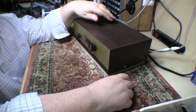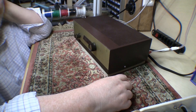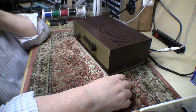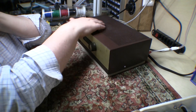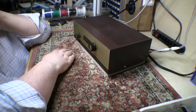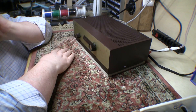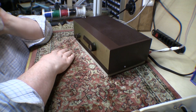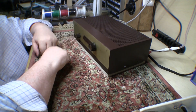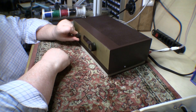So I think this transformer — I don't know what the life of this transformer is — because the fact that the magnetic field has changed, clearly this wasn't coupling like that when it was new. So there's something inside in the windings that's changed from before. But at least for the moment we seem to be back in business, and it sounds pretty good.